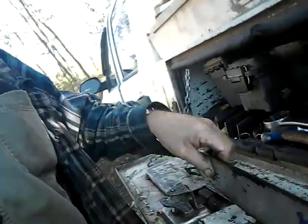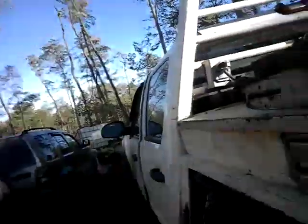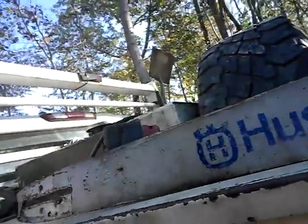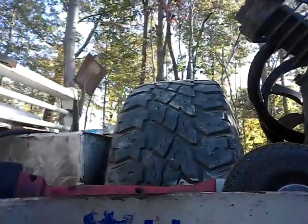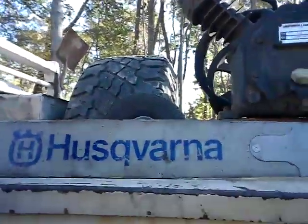So we threw this back together and if you can see right here — see that hot spot on the bar? I'm holding this camera so I'll try to prop it up so you can see it. See right here? It's like blue right there. What was happening: you had burrs on the drives and it binds up, heats up, and it's not good for the rails because it weakens them.